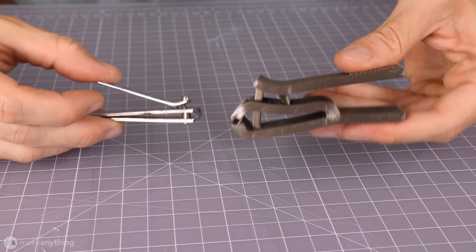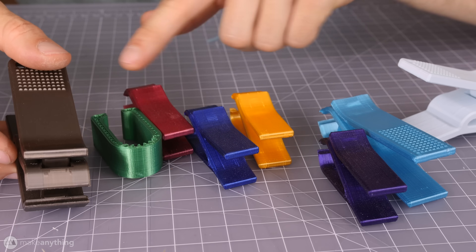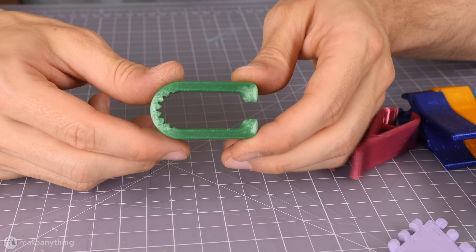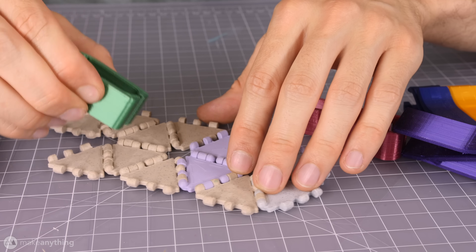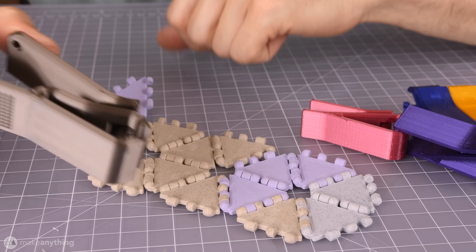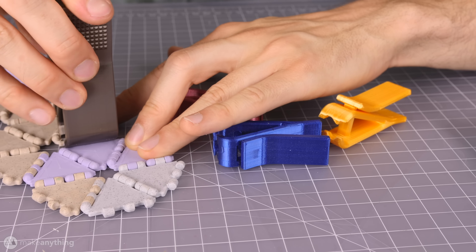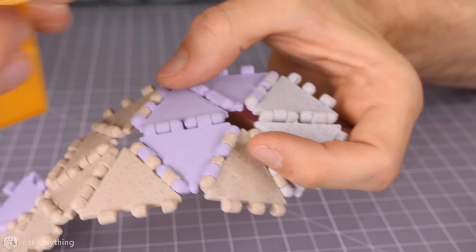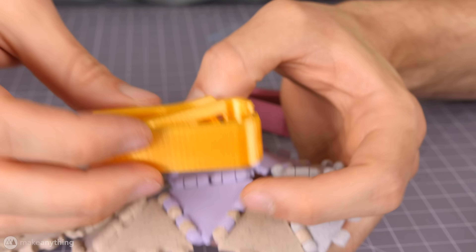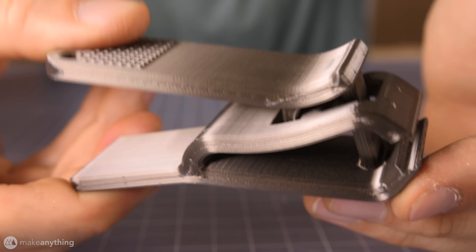It's a pretty handy little tool. This thing works great, and even though it looks like a direct copy of a nail clipper, that doesn't mean it was super easy to make — I actually have a lot of prototypes. These were pretty much all printed using PolyAlchemy Elixir filament, that's how they got this cool shine to them. I started out with a much simpler shape — this is just a C-style clamp. While this thing does work, it still requires basically the same amount of force, and that's why I turned to leverage to make it so that you can use much less force to stick together these panels. At first I was trying to make these as small as possible, but I found that this size works the best. I also played around with the idea of using teeth so that depending on how you align it, you could use it to either snap parts together or take them apart. But that never really worked, and taking them apart is just a matter of tearing them apart. So I decided to just focus on the connecting side of things.